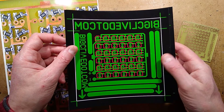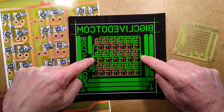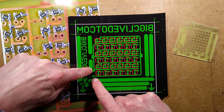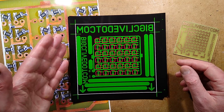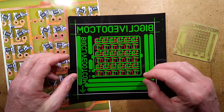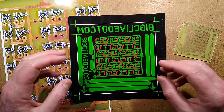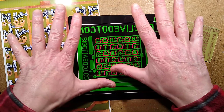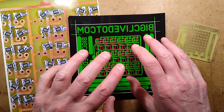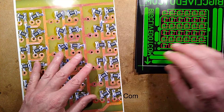I made an array of LEDs with surface mount resistors, and the whole lot are in parallel. You've got a couple of pads to connect, or you've got these terminals, which are the ones I will eventually connect to a USB lead. It draws about 400 milliamps. It's got 64 green self-flickering LEDs. The result is, as you saw from the thumbnail, just this splatter of beams of light coming out, with each one independently flickering. It looks really nice and is extremely low power.